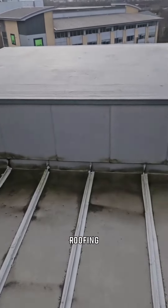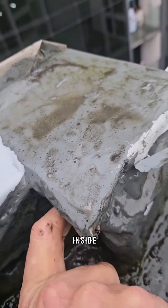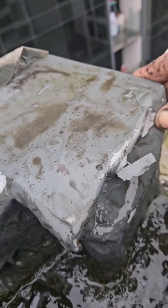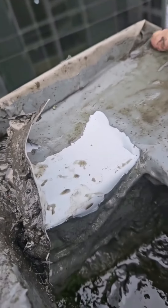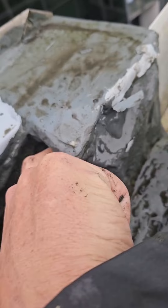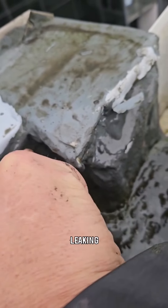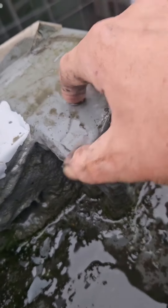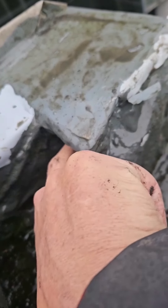Some seriously bad roofing repairs here. I've got my finger inside this patch and it's all soft — that's a problem area. What needs to happen here is we need to remove all this and have a proper look inside, because I've got my finger inside the roof there. I'm assuming it's leaking inside this repair, getting to the point where it's getting in through the original roof. I can see I've got my finger inside the roof space there, back down to the zinc.